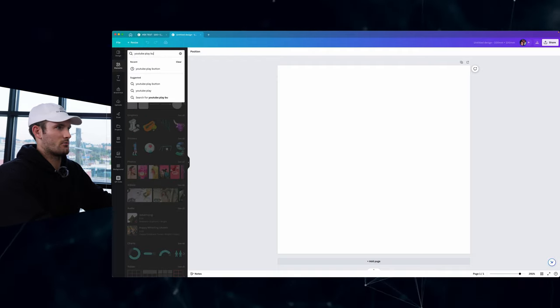Back to my actual design — I did pretty much the same thing. Remember: your border needs to be about double the size of your insert. My insert was 10 millimeters thick (9mm body plus a 1mm chamfer, as you can see). A big takeaway: after you import and get it set up, remember to do the Project and then the Offset so it fits in properly. Also, add a chamfer around the edge of the insert — this prevents elephant's foot. Since we're placing this face down for printing, sometimes the first layer sticks out a little, which prevents the parts from fitting together properly.